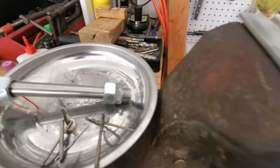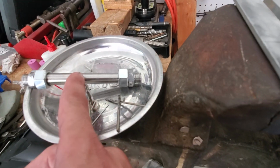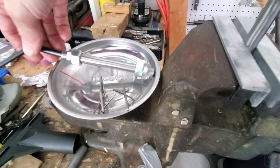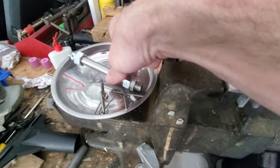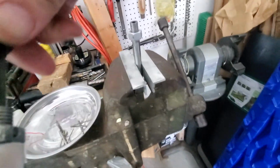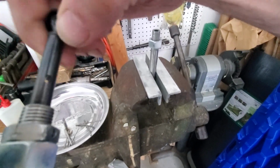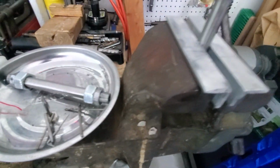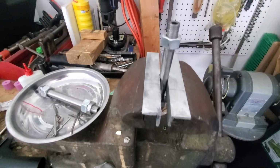Now next up is to cut each one in half and bore out the tips to 8 millimeters so that they'll receive the shaft on the correct side instead of on the wheel mount side. That has to be bored. It's not quite a good fit. And that'll be on the side that goes on. And this will be the side that takes the wheel and turns it. And I'll have 4 at 60 millimeter extensions.